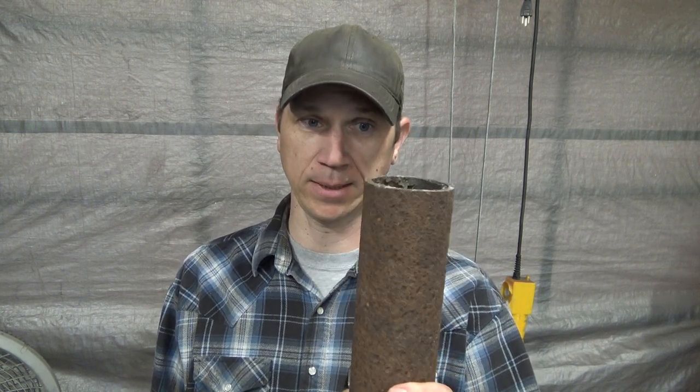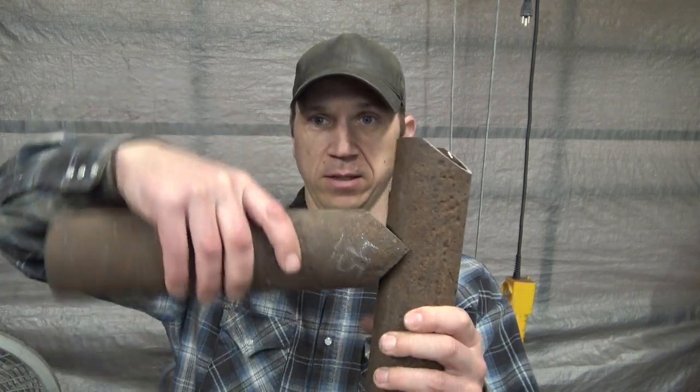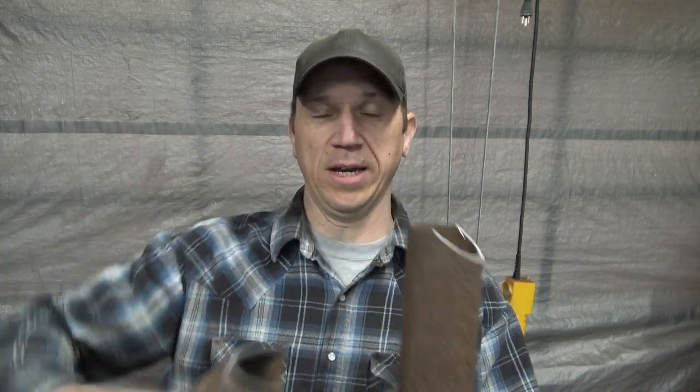The basic idea of using your chop saw or band saw to make saddle cuts is you cut the end of your pipe off really nice and square. It's important to keep that end square and nice and pretty. Then you figure out which angle you need your band saw set at, and that can vary due to the size of pipe you're joining, the wall thickness of the pipe, and the angle at which you're joining the pipe together.